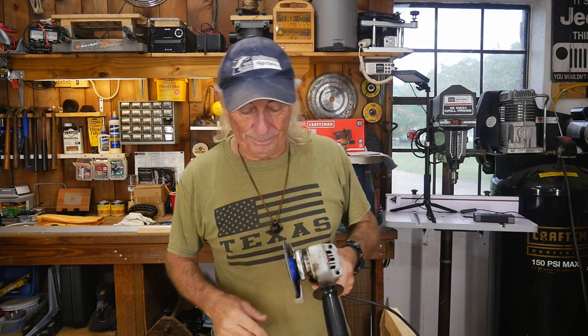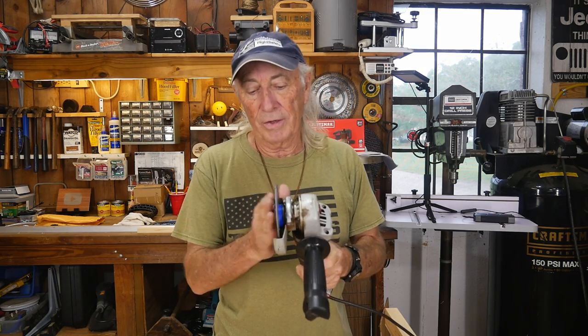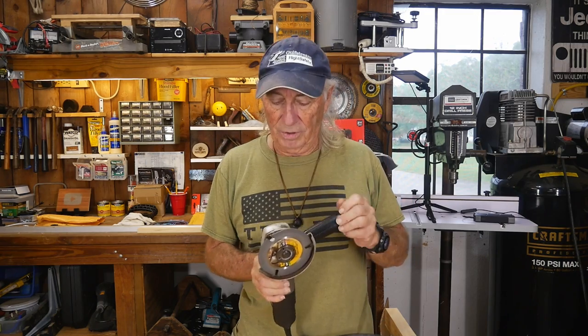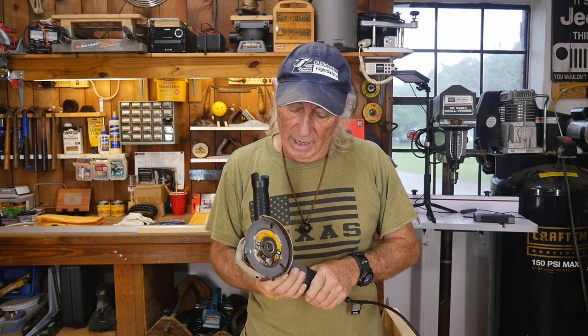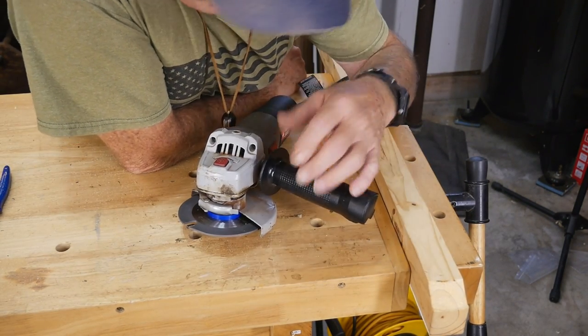And I did something I really didn't want to do, but I went to the 3D printer and I made myself an adapter fitting that would raise the blade away so that it won't hit the guard here, so we can use this. The other thing I had to check on, and you'll have to take a look again, it should be the same, but I made sure that this is facing outward so that the blade is traveling the right way, and also sort of jogged my grinder and watched it come to a stop to make sure that this wheel is actually turning in the correct direction, obviously. And so now we're ready to play with this little weapon. All right, just before I get started, I thought I would just go ahead with my silly washer.